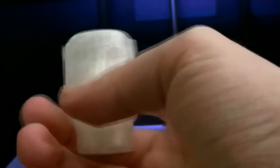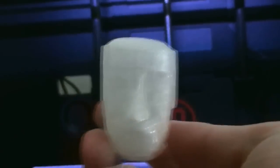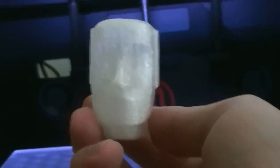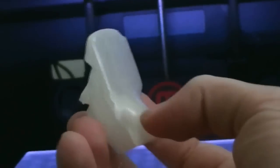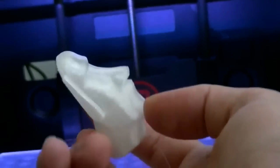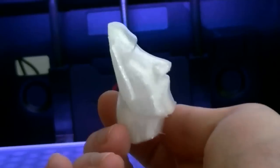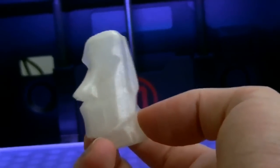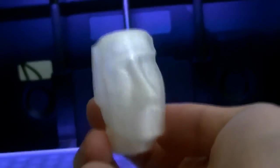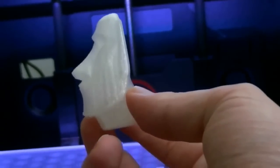So this is frankly a successful object. No burnt part on it, and I realize that the burnt parts just come from the fact that the extrusion head is very hot, and when it encounters some solid parts or some freshly solidified parts of the object, the problem is that this very hot extrusion head is just burning the underlying material, and that's why it becomes ugly, and it takes a strange color.